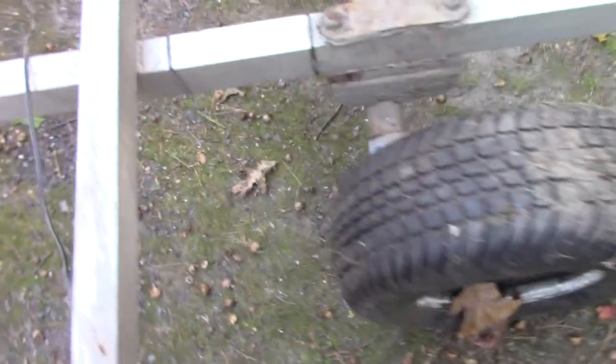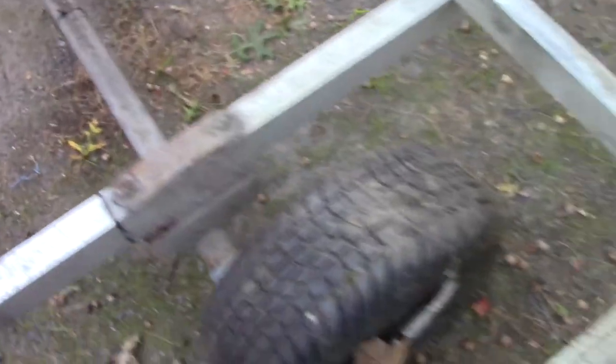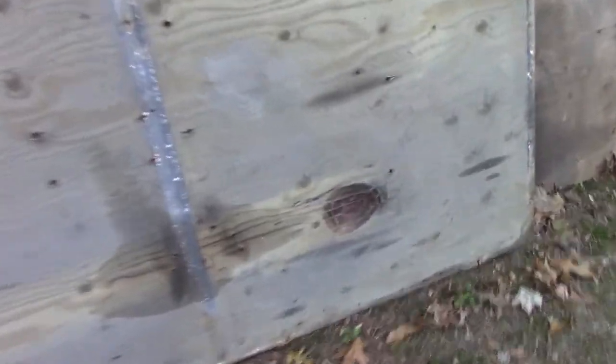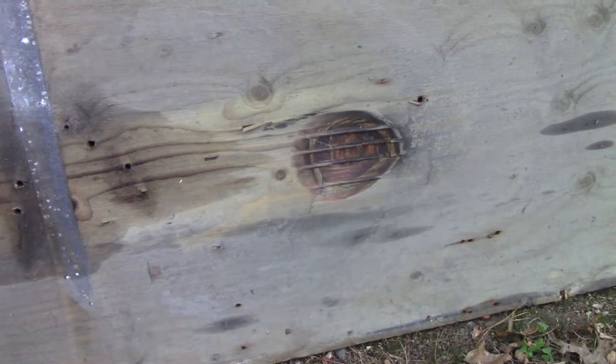The outsides of the tires are good - I could flip them around at a tire shop to wear on the other side - but there's a reason why they're cupping. I don't think there are any adjustments for toe-in, toe-out, or camber on these. I need to raise that axle because there's actually a tire wear mark burnt into the wood - tread marks pressed into the decking.